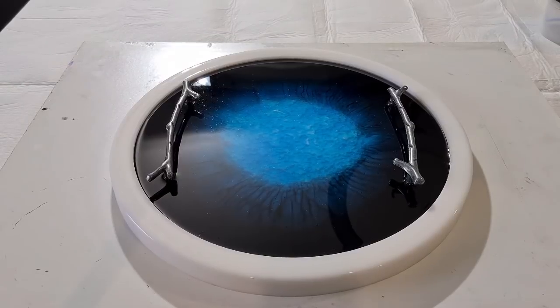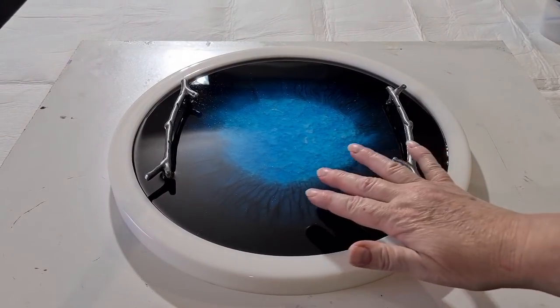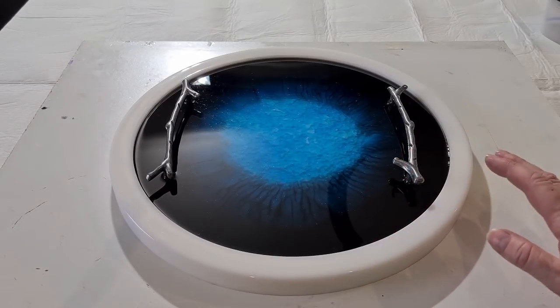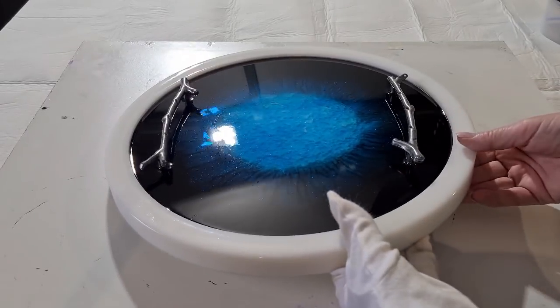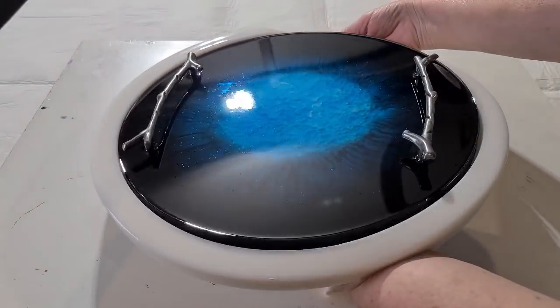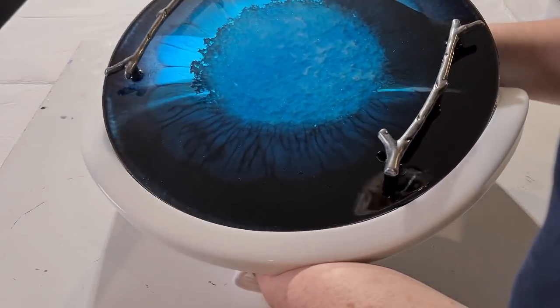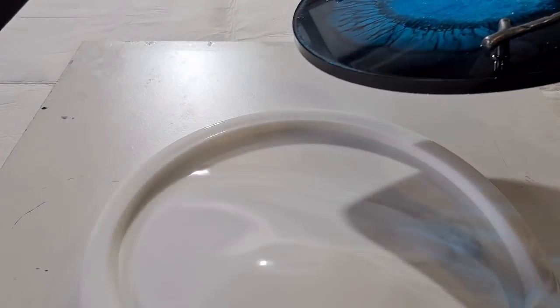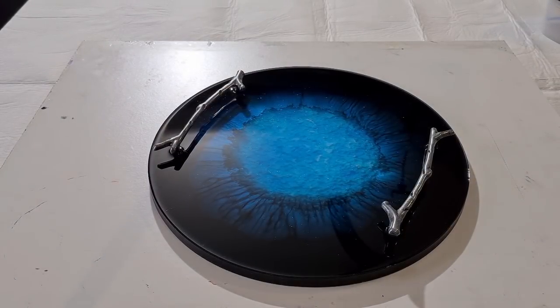From what I can see there's nothing — no amine bloom! The best way to see it is looking across into the light. Yay! Let me get you on the tripod and we'll unmold this baby. It's still a bit fresh — if I pressed my nail down it would dent — so I'll be really careful. It's Easter Sunday here in Australia, happy Easter! I'll just take that tape off. That's the bottom — that's the main mold — and there we go.